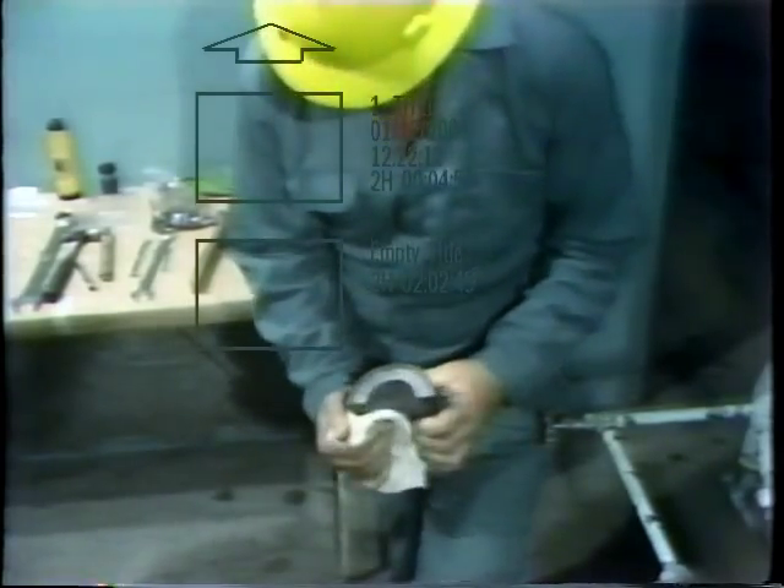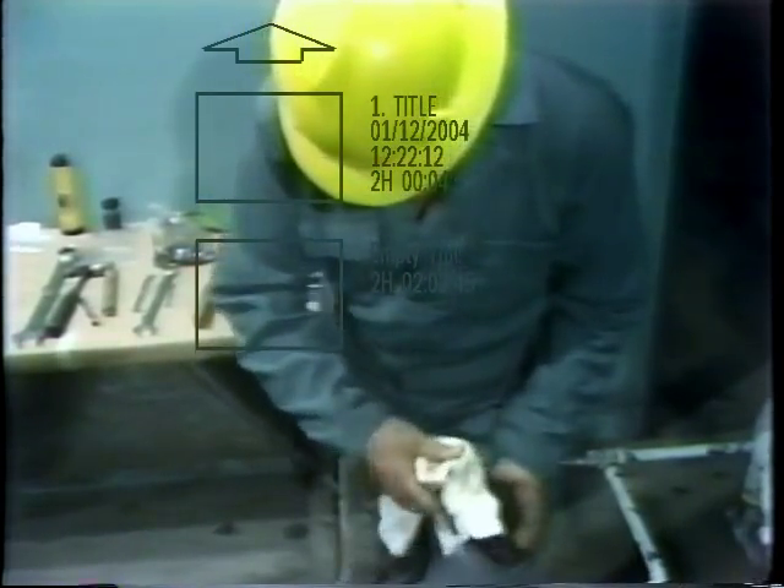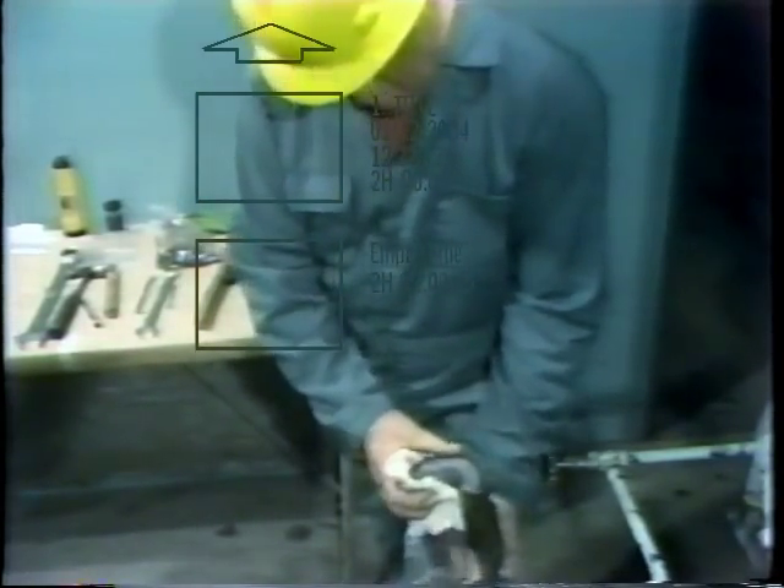This shell also gets a thorough visual examination as soon as it's removed. He uses a clean lint-free cloth to wipe off any excess oil remaining on the shell before visually examining it. His visual examination shows no obvious signs of damage, so further investigation will be required to determine why the bearing was running hot.